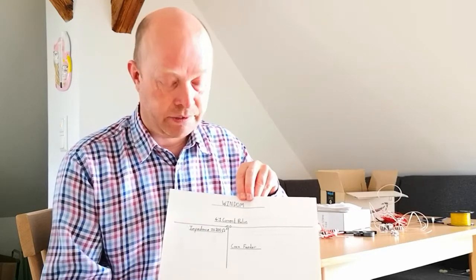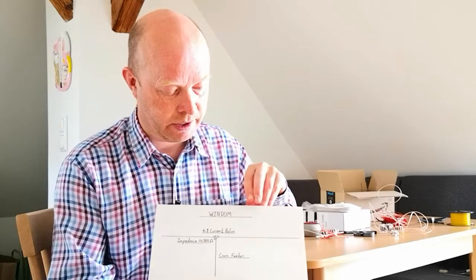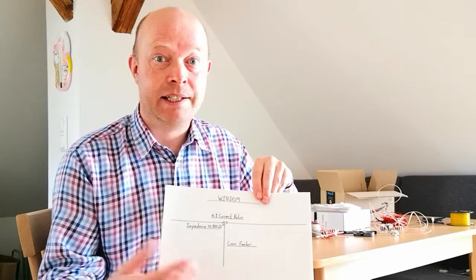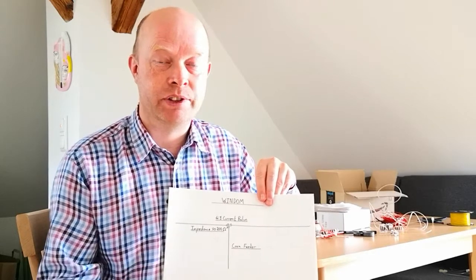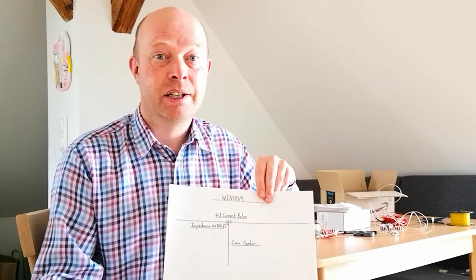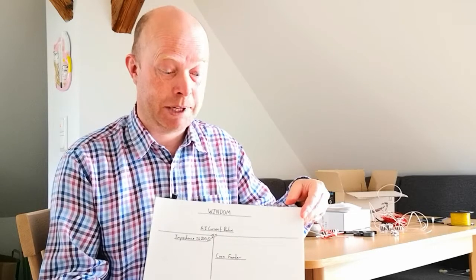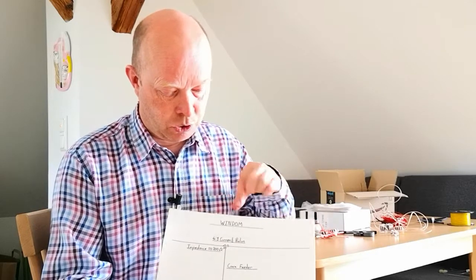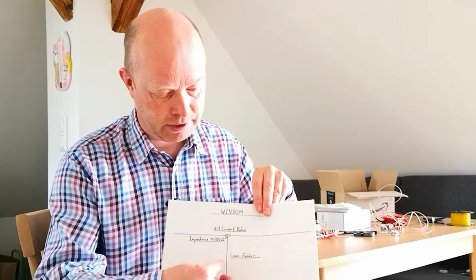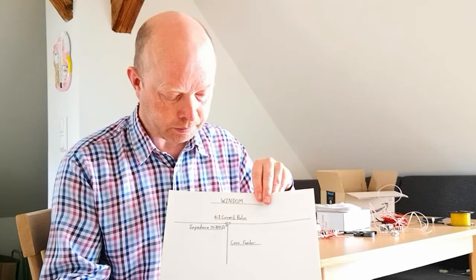So yeah, this is a very useful antenna, and I think a lot of people agree that the benefits of a Windom generally outweigh any disadvantages it has. It's far more versatile, and whilst it may not have the best radiation pattern of any antenna, its versatility makes it really the antenna of choice for most hams. So there's a normal Windom, and you can see we've got our 4:1 current balun at the feed point, bringing the 200 ohm impedance down to 50 ohms.